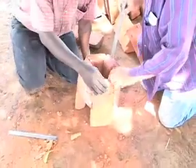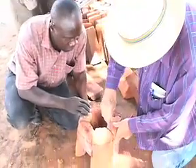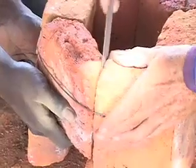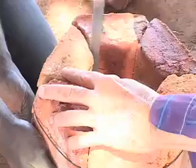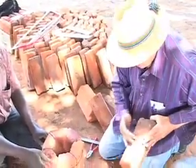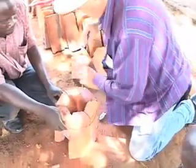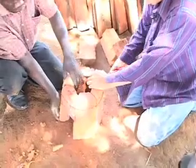Your angles are pretty good, so your mold was pretty successful — the bricks shrank about right. It could be just a hair different, but it's definitely very good. Here I'm getting the slight warpage in the brick to be straightened out by the abrasive on the blade. When the bricks burn, they warp a little bit — they curl. When assembled, you want to cut this little high spot off with the blade where the brick is warped. If you don't do this, it doesn't matter very much, because it's a wonderful stove even if those cracks are in the side. Now I'm going to tighten the wire a little bit more.